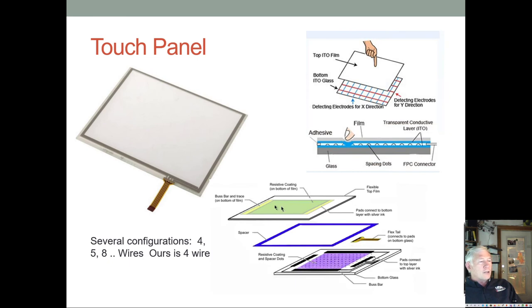And that's true for each axis. So then you do it for one axis, and then you flip it around, you turn off the voltage here, you tri-state these, and then you also have another one connected that connects it to the A to D converter on a different channel. And then you put power and ground across this panel, and then wherever it's touched, you can sense the voltage, you can sense the X voltage here, the Y voltage up here, and that gives you your XY coordinate. And you switch those back and forth, maybe at a rate of several thousand times a second,